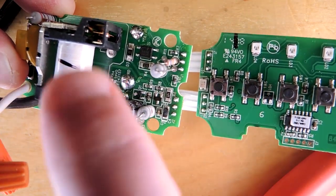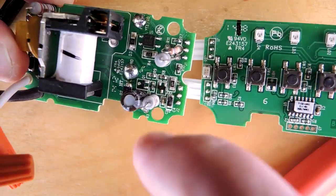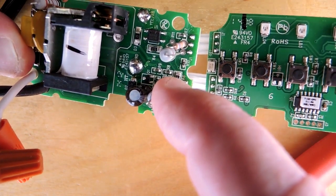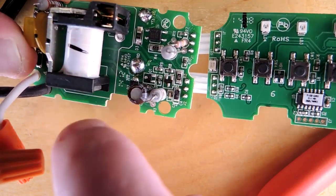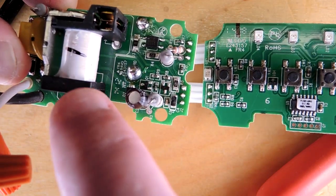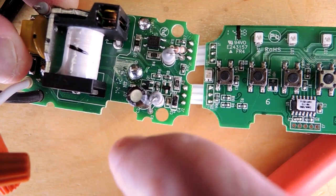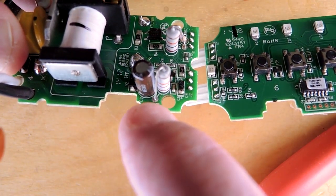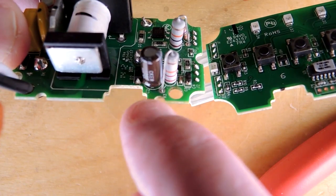It falls back out, then the power supply can build up and try drawing it back in. Two possibilities: either the driver transistor has been under-designed and just doesn't have enough current-carrying capability to hold position, or — much more likely — the power supply going to the relay is inadequate. As it pulls in the relay, the supply voltage drags down and the circuit disengages.